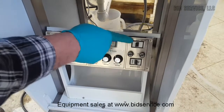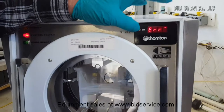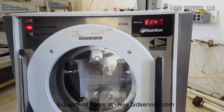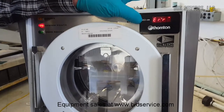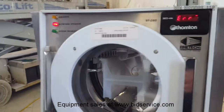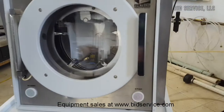We're going to run in manual mode for the essence of time, because resistivity is going to indicate low. Now this is your resistivity monitor, and it's reading high right now because there's no water flowing across it. Normally you would want something 12 or higher usually, depending on what you're running. That may not be an important factor for whatever you're doing, but our media has expired. This is our DI source, and as you can see we're very low on that, so our media has expired and I'm not going to be able to get a high reading. That being said, we're ready for operation.